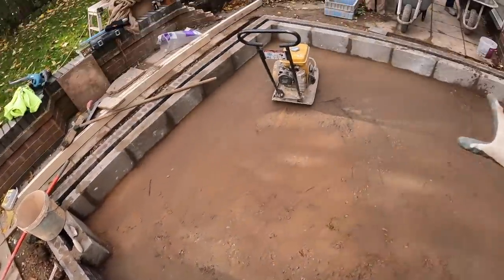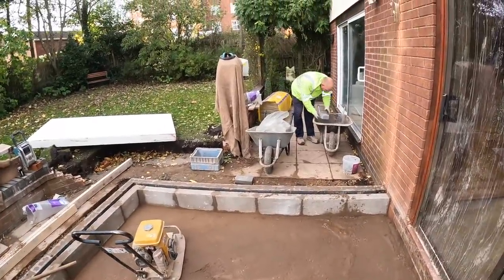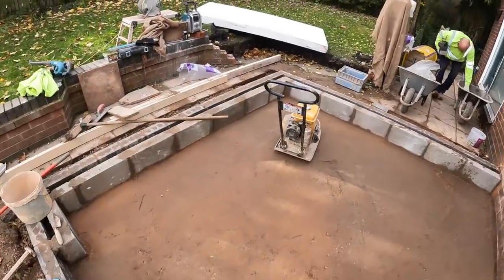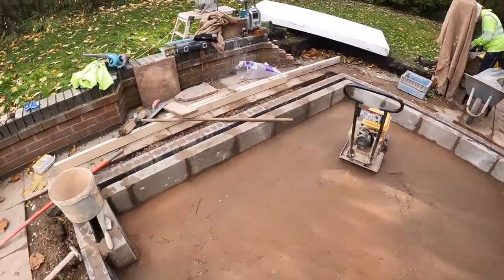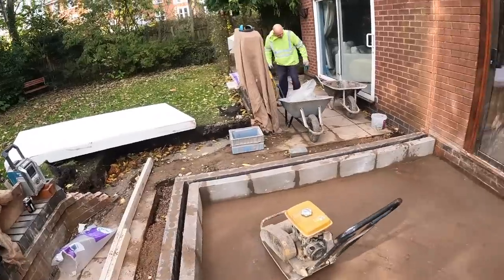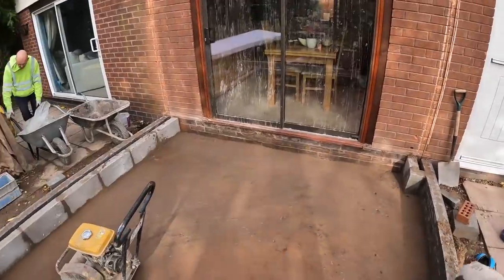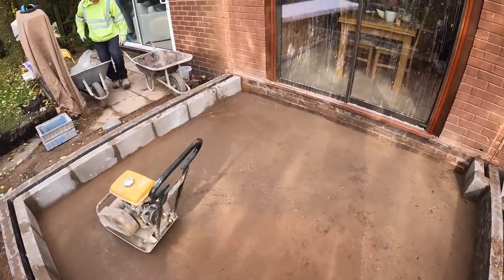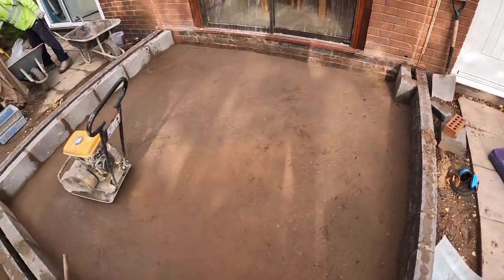We've got our nice thin layer. We used about 3.5 bags. So we've got some ready for another extension or whatever next anyway. So like Dad said, Visqueen time, and then it'll be the jablite, another layer of Visqueen. Then that'll be us for the day. Come do the concrete tomorrow, we hope. So let's crack on, shall we? Let's go grab this Visqueen from the van.